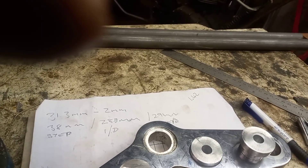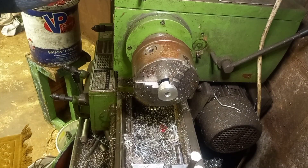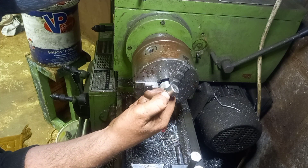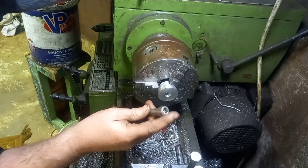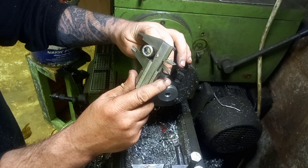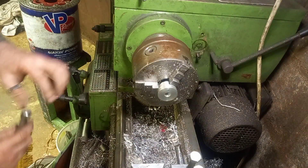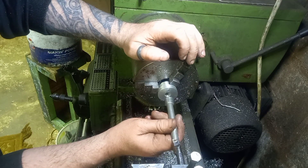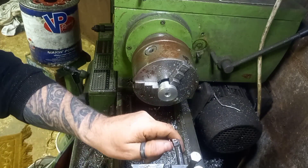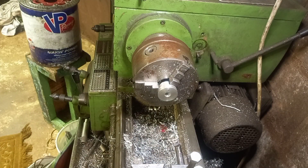I'll get these back in the lathe now. This is the bottom one where the bolt is going to fit in. The shank on the head of the bolt is about 12mm, so I want to bore in about 12mm and the depth is going to be just over 17mm. So I want to go from 12mm to 17mm so that it fits in there neat. I'm not going to measure on the scale there but I know that's about the depth I need to go.